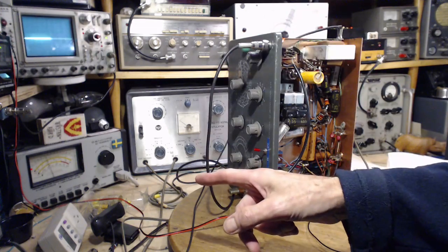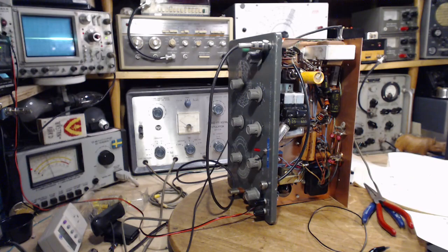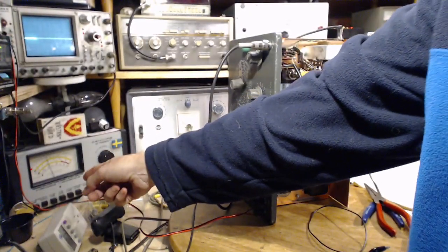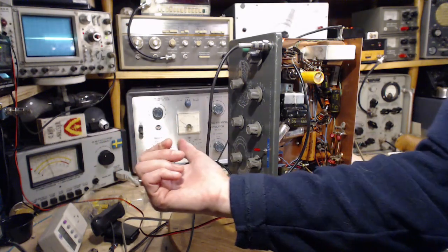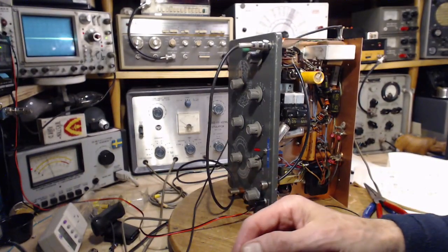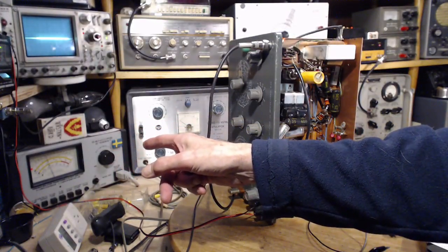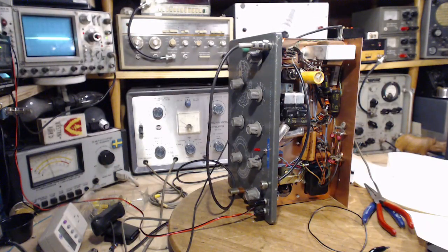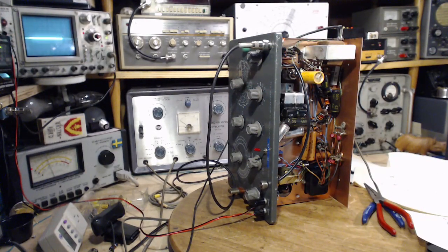We're going to turn on the power at the lower voltage, and what are we going to watch? At that point, we watch the dim bulbs. We put the power through the dim bulbs still. I could also switch this to wattage, but I don't know what to expect here. If there's a dead short in there it might throw my meter right over, I don't know. Let's leave it the way it is. So we have 50 volts coming. Will the dim bulbs come on? Did those bulbs come on normal and I just got cold feet and didn't leave them on long enough?